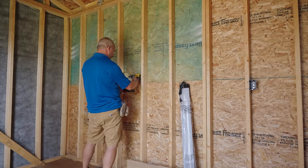Now, let's get a couple more staples in here. Let's get it down to the other box, and then we can wire the next receptacle in a position where you'll be able to see a lot more clearly. All right, now I'm going to put a loop on it for extra. There, and then enough to work with.